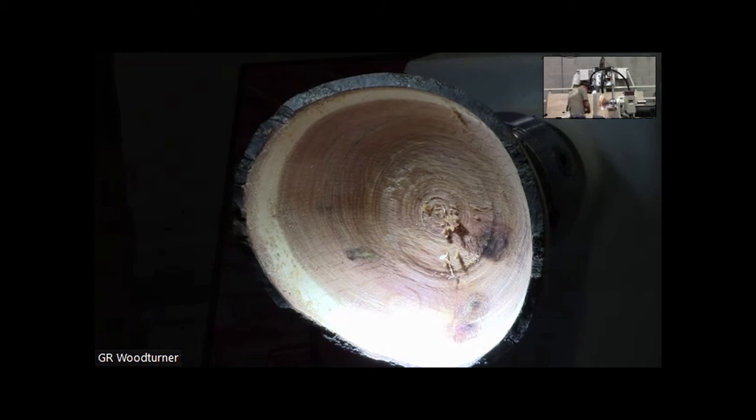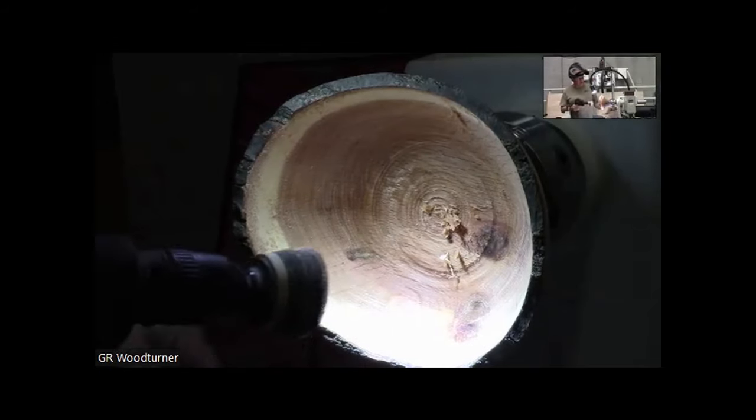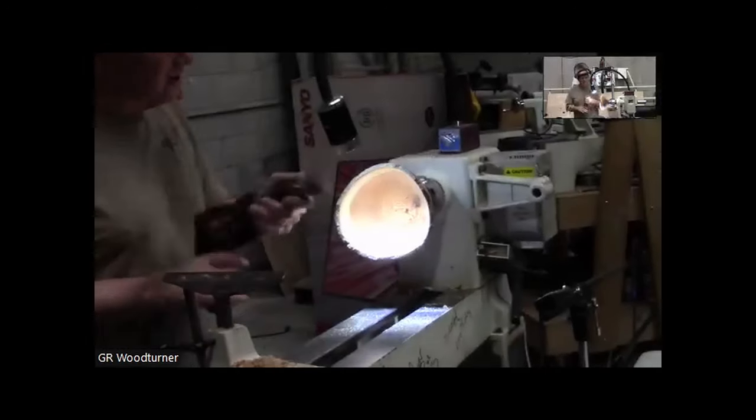But anyway, as I normally do, I'm power sanding. I don't even need to. I can just show this stagnant. That's fine. Most of the bowl, I can power sand while the lathe is running, and it won't be a big deal until you get out here. The difference in height of that bark is going to grab this thing and tear it up, kind of like it has a little bit already.